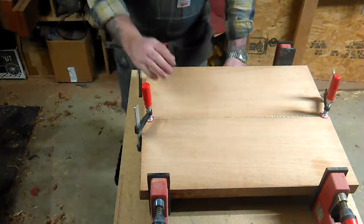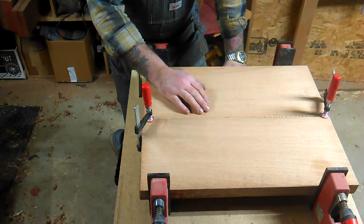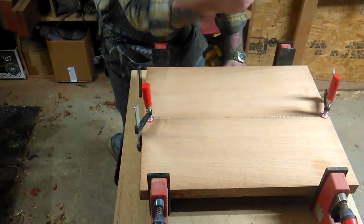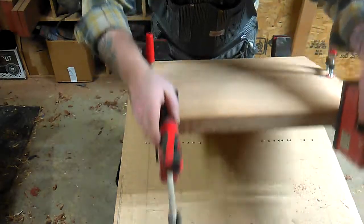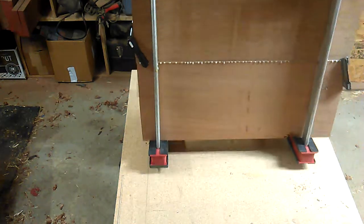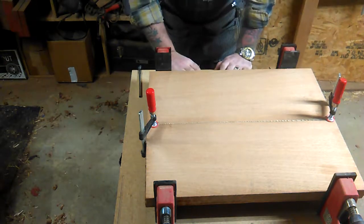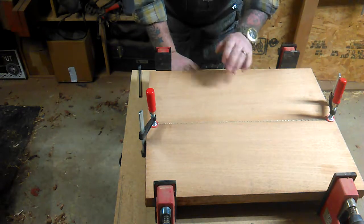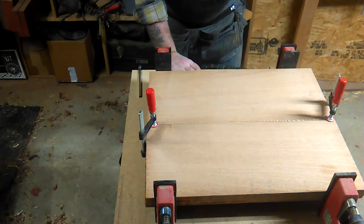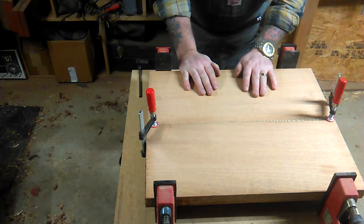By using a little bit of glue, we only have a little bit of bleed-out here. I could wipe this right now, but because there's such a small amount I'm actually gonna let this flash off for 20 minutes or so — it'll get a little gummy and at that point it's really easy to just slide a chisel across there and peel that whole piece off. You should have some squeeze-out on the back as well, as you can see we do — that's a sign you got good glue everywhere. We'll let this sit overnight, tomorrow I'll unclamp this, clean it up, and she'll be ready to cut into shape and make a body out of. Thanks for watching guys.